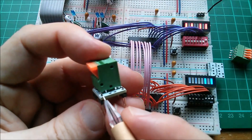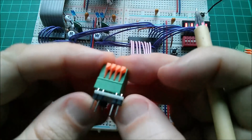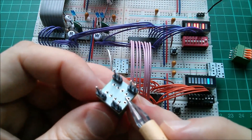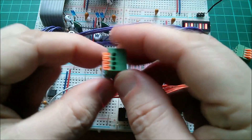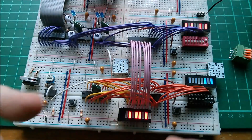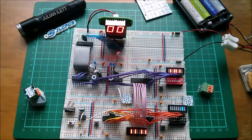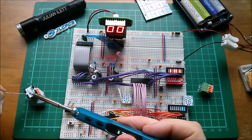I think I slightly underestimated the dimensions here — possibly if I increased the dimensioning this could sit flat. But it doesn't actually matter that it doesn't sit flat; those pins are far enough through that I can solder them. That also gives me the possibility to drop a wire in here — pull this lever down, drop a wire in, bridge it across to this other one, giving even more power distribution.